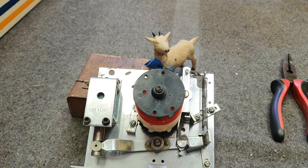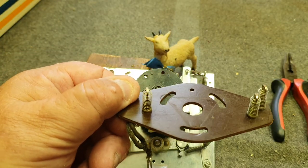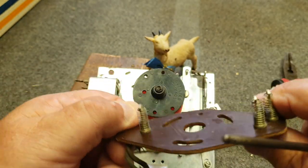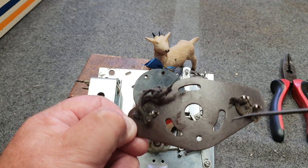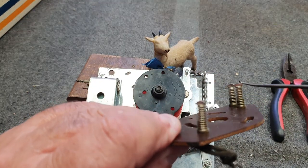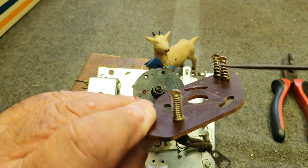Anyone that follows us knows that we're very prone to using kerosene — it's one of the better cleaners I find to use. You'll also note that the plate with the snowshoes or contact pins are quite sluggish as well. What we're going to do is take the old braid off and put new braid on, take those snowshoes out — so you've got to solder here, here, and this one — take them right out and if necessary replace them. They're not too bad, still nice and rounded across the top, maybe a little file, and just check the springs — they might be dirty down in the shaft — so we'll clean those out.